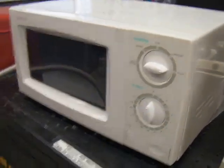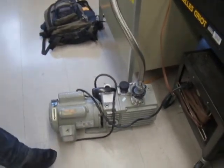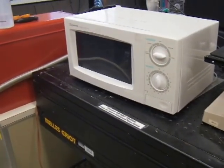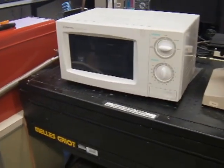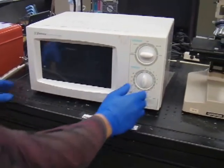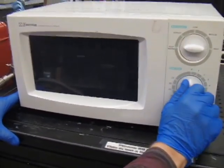Now you engage the vacuum pump. The vacuum pump will pull the chamber down to on the order of about 50 milliTorr. This process takes about five minutes, but you can see the initial effect by just turning it on. Even though it's not the correct pressure, the effect will still take place — it's just not ideal.